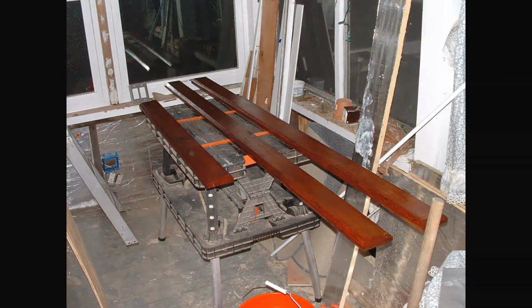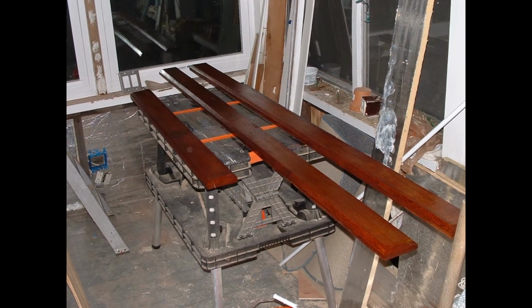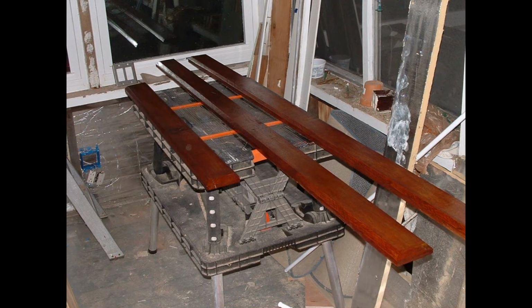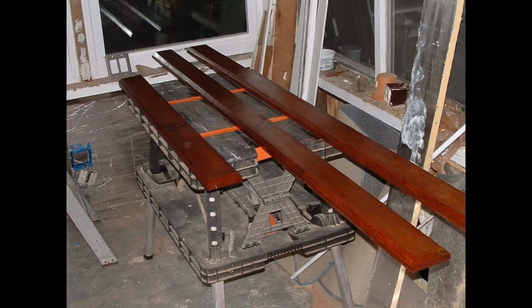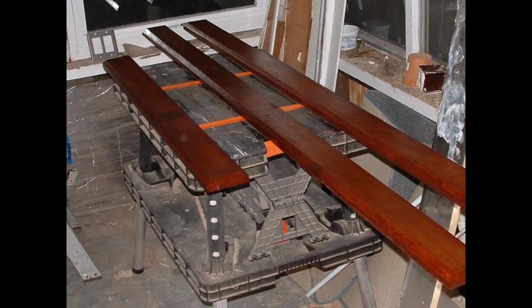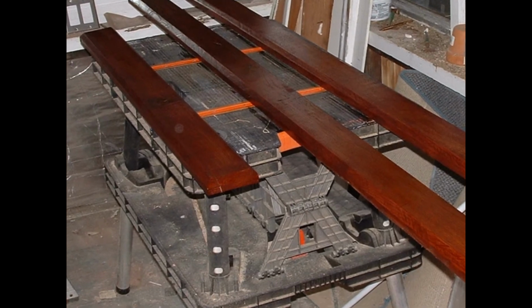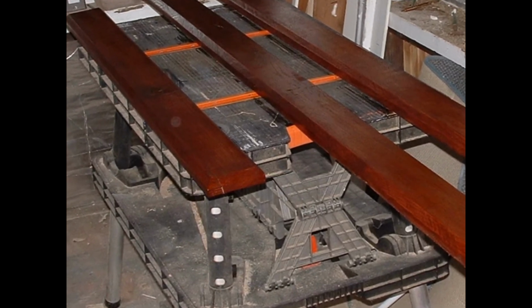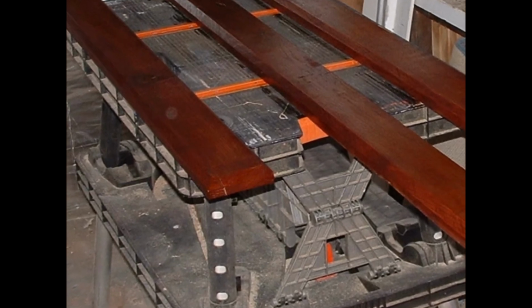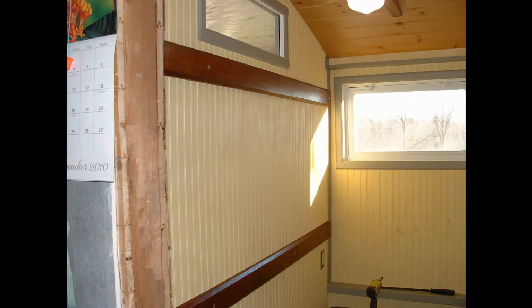And because this room is called the cloakroom, we needed a lot of hangers. To put the hangers on the wall wouldn't work because the wall was basically that thin beadboard. So we got some rough sawn oak plank and beveled the edges so that it looked just like some originals we had seen that were painted. And then we put our 7 coats of shellac on it, and here you see it's out on the porch drying. We mounted them in 2 rows, a high row and a low row.